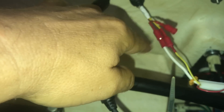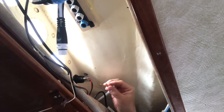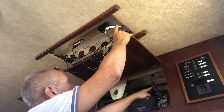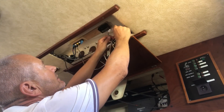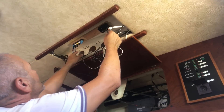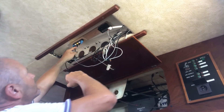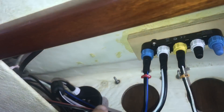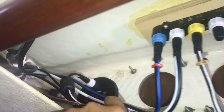I didn't need the live wire in the end. There are the other wires which I'll connect to the NMEA 2000 backbone. This is the conduit from the ST7000 which I've got in here. I've spliced the wires into a chock block which then goes to the NMEA 0183 converter, and then that all goes to the i70 multifunction display.